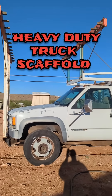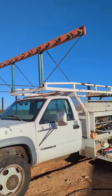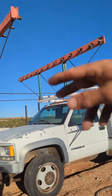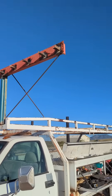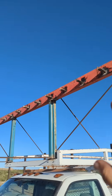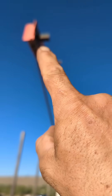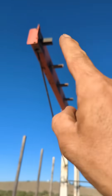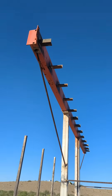It's the end of the day and I just completed the framing. I need to go to the store and get some lumber and plywood to set on top. What I did here is weld angle iron every foot all the way down, and I'm going to run some 2x4 rafters across and screw them into the angle iron. These are on pallet rack beams, which I love to use.